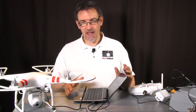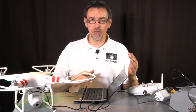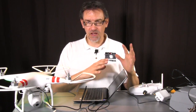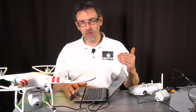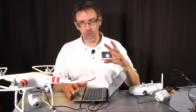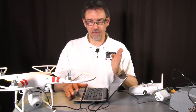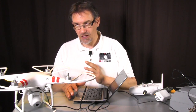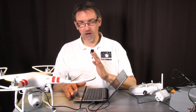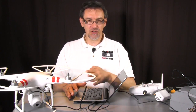And another thing I should say that's also important, when you've changed to the potentiometer mode in the firmware update there in this small program, you cannot do the tilt function with your iPad or with your smartphone. You have only the choice smartphone, that's the Phantom 2 mode, or you have the choice potentiometer, and that's the I think H32D mode or something like this, you know what I mean? So you have only the choice between potentiometer and smartphone. There's no option to have both.